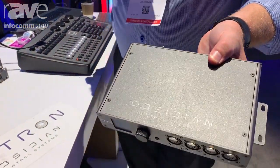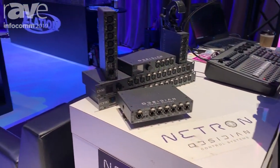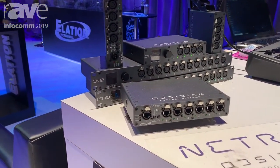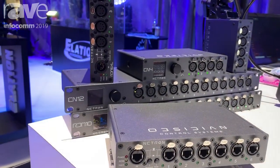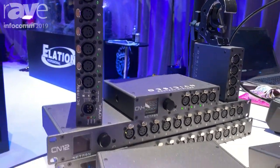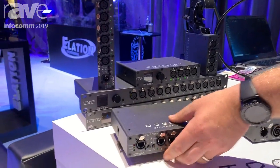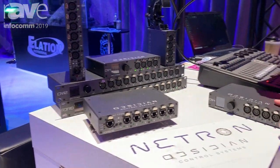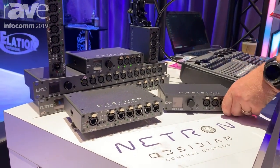This is a range of multiple splitters: 5-pin, RJ45, and a 10-output AB splitter with integrated ArtNet nodes. Those are the three splitters we offer. These are rack-mountable, wall-mountable, and DIN rail-mountable — all these mounting options are included standard. All of these are line voltage pass-through. It's quite an intelligent little system.